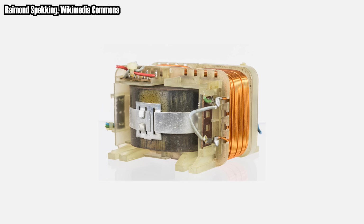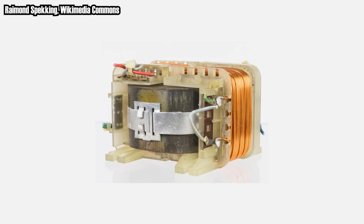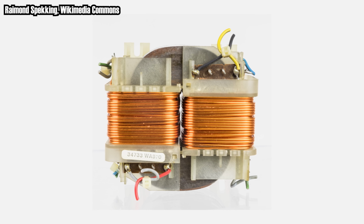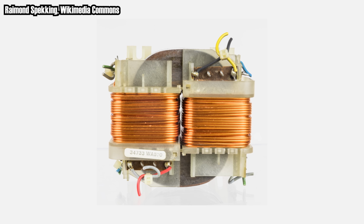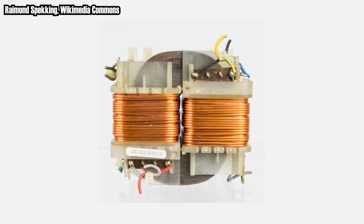By 1967, it was relatively trivial to produce high-powered oscillators which ran at that frequency, but that wasn't the main issue. Because of the required high frequency, wrapping wire around an ordinary iron core, as found in most power transformers, wasn't feasible. At those frequencies, the eddy currents, which form inside the cores, would cause it to get extremely hot. That's the mechanism by which induction cooktops work. But the problem is, that would limit both the efficiency of the power coupling and how much power you could feasibly transfer into the tube before the core started to melt.